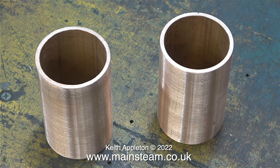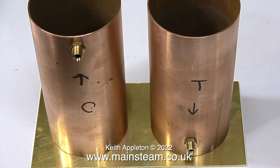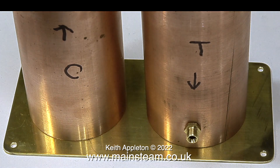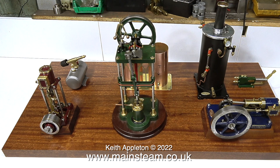What I'm supposed to be doing today is cleaning up copper piping and replacing some of the union nuts. I find the manual cleaning of thin copper piping to be very tedious. I'd like to show an excerpt from a video I made a few years ago — exactly the same principle: a condenser and a water tank on the same bed plate. Although that copper tubing had a much thinner wall, the principle is the same. If you mount the water tank and condenser on a common bed plate, the heat from the condensed steam in the condenser warms up the bed plate, which in turn warms up the water in the water tank. This steam plant from a few years ago showed the condenser-water tank unit behind the central engine, and it worked very well.